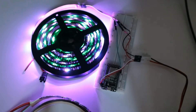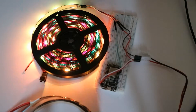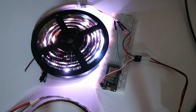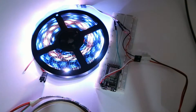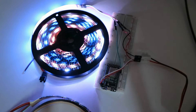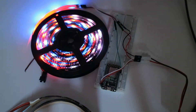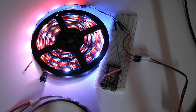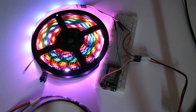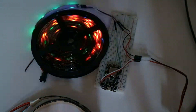This is the second, more complicated operating mode. I split my LED strip into two parts: a one-meter part and a four-meter part, which also gave me the opportunity to test how an external power supply works. In my case the external power supply is an old PC PSU — I used the red wire (5V positive) and black wire (ground) from a molex connector. Note that due to the power consumption, much more current goes through those Dupont cables than it should, and they could heat up and burn — so don't do this for real, I just did it as an experiment.